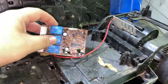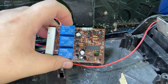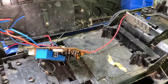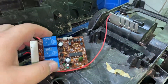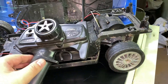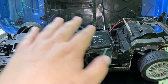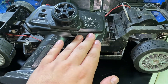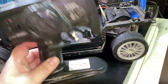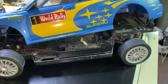It probably goes directly from the relay to the motor, so the board only activates the relays - there's no stress or voltage on the board itself. Since I don't have the remote, I don't think I'm going to make the higher speed work. I could swap the board or make a custom board with another relay, but there's no point - it's just a toy-grade car. I have another controller that's 27 megahertz, and when I opened it, it has a slider plate instead of a potentiometer, which may work with different speeds.